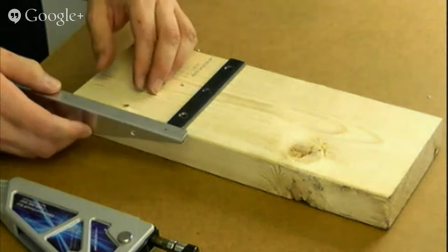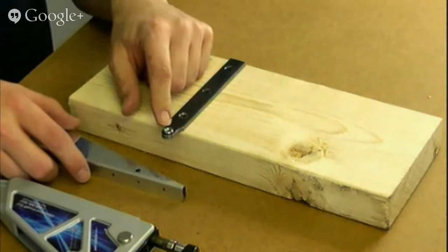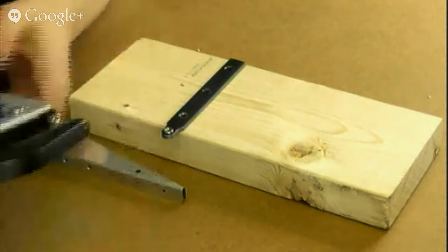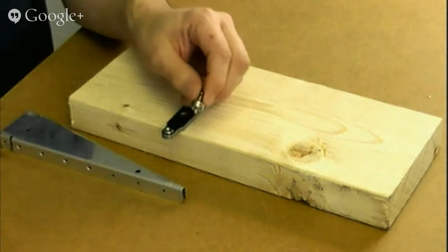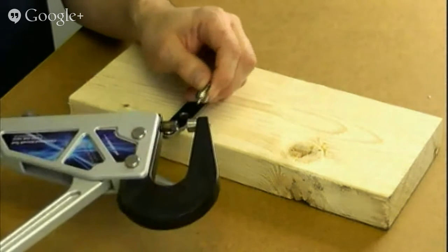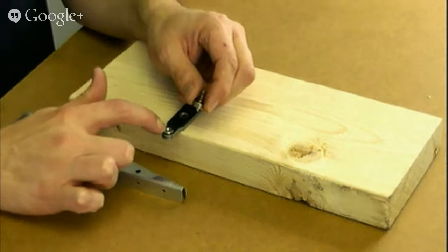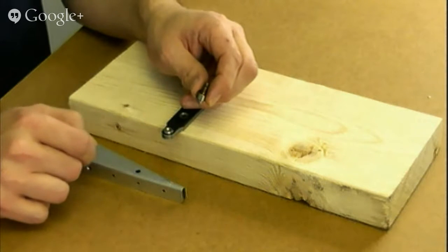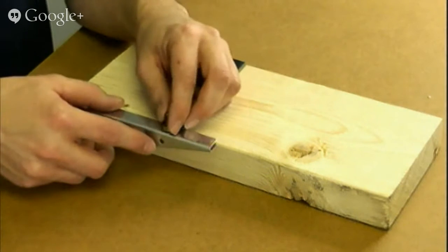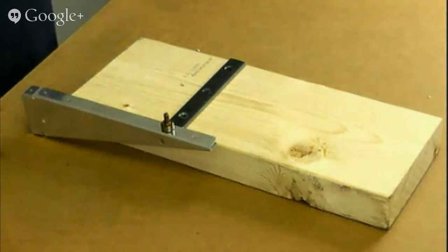It's one of those things where it's nice to just be able to walk over and have it ready. Once it's sitting over the edge of the bench, you can hold your part over it and that gives you the female dimple for the inside of the fixture. You'll need to use the male die out of your standard male and female dimple die set. How do you compress it is the question we get most often.